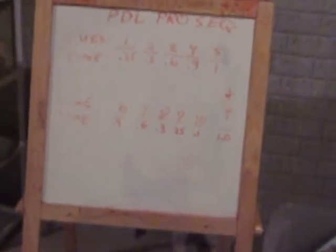What that means is, as the firing system fires off, the times are the delays. As soon as this thing takes its first signal, the first cue will fire. Then that first cue time is the delay between cue one and cue two — so that's 0.25 seconds. As it goes all the way through, when it finishes cue ten, you can see the time output there at one full second. We're going to do a couple of dry fires, then take it outside, dump it in some water, and fire off some e-matches.